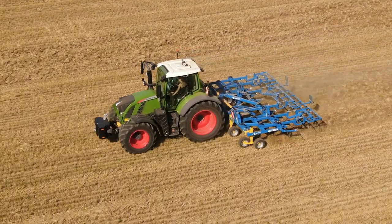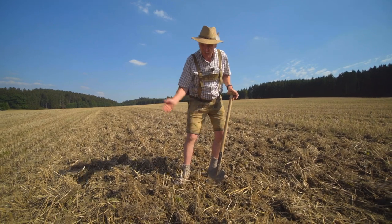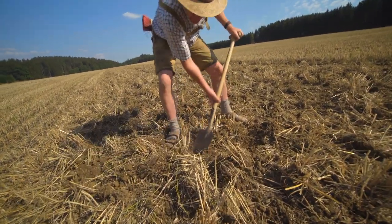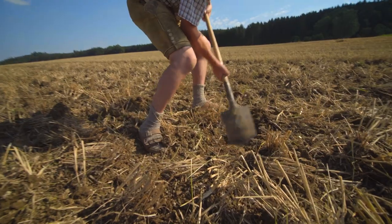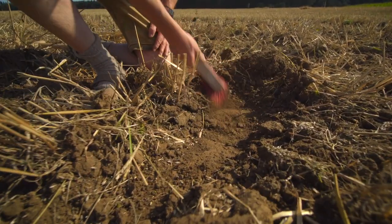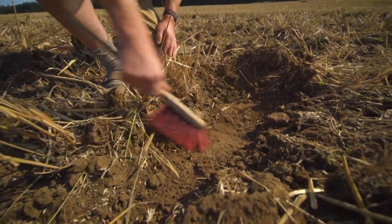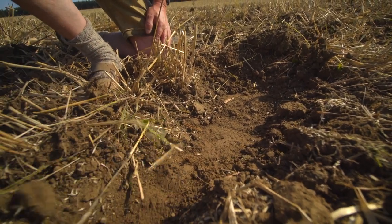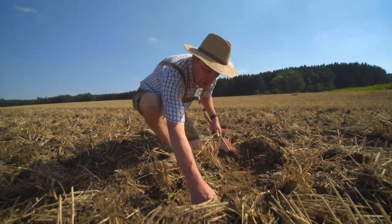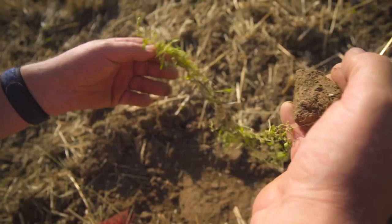Here we are standing in the stubble field. The cultivator was set to about three centimeters for the first stubble fall. The stubble is a bit long — this could be mulched in advance, but it is not absolutely necessary. The cultivator also works here without obstruction. Again, we see the entire area cut with a clean work result. Nothing has been smeared; the pores in the soil are open, and as soon as the rain falls, it can penetrate into the pores. The weeds, which are now on the surface, can dry up. Here, for example, it is chickweed — great cutoff, and now the sun will dry up the rest. This is what the sun gives us, for free.